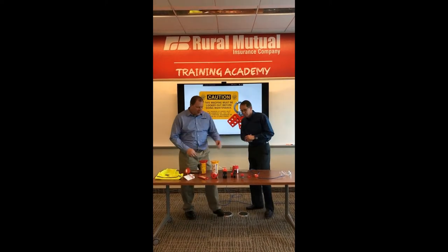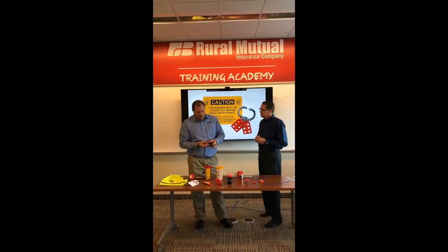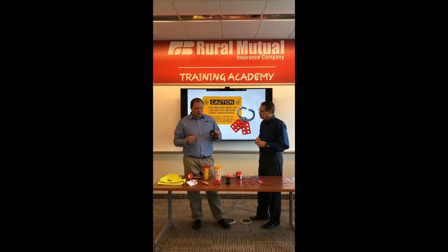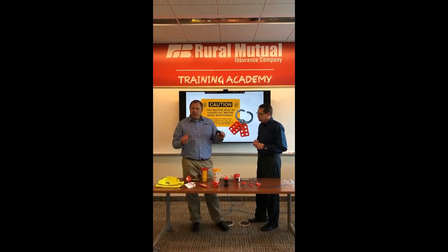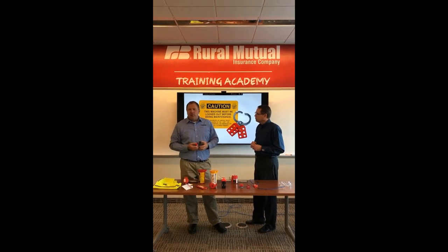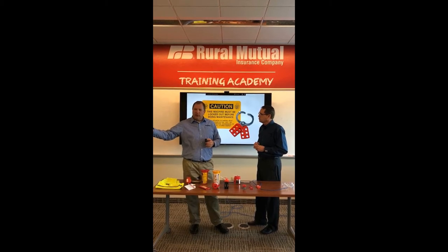Sure, absolutely, Bill. One of the ones that I see most commonly used is the circuit breaker devices. These are very simple to use, and they're very cheap. You can buy a bag of these, and it's easy to use them to lock out your power source if that's the only source of energy you have for a piece of equipment. Say a piece of equipment that's downline that we just want to shut off there, and we don't have a knife switch or some other type of disconnect.